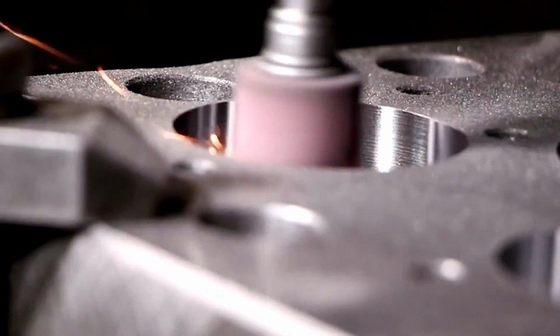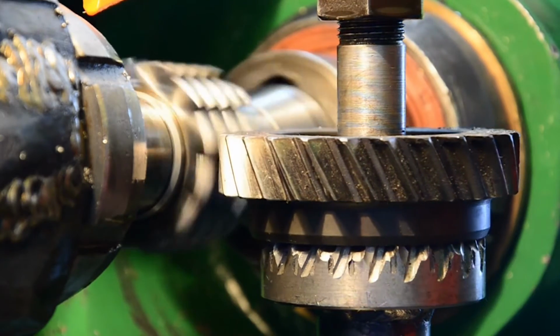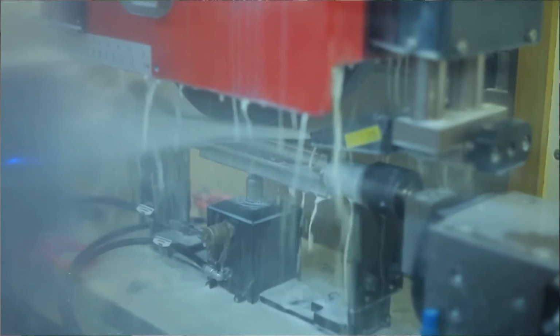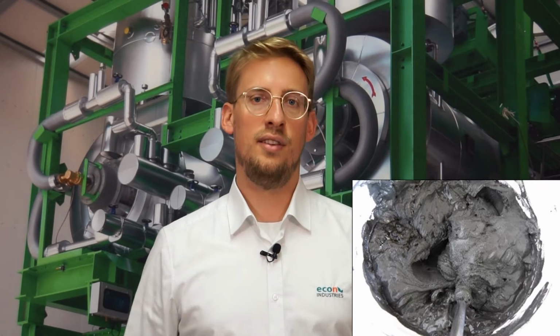Where do they come from? From various manufacturing processes. For example, when making metal bearings, thick-walled pipes are cut to an intermediate size and then ground to the required final size. This process requires the use of cutting or grinding oils or coolants, and afterwards the fine metal shavings are washed out of the system. The oil is then filtered and recycled, and the remaining filter cake is the grinding swarf.